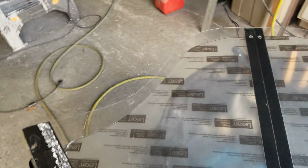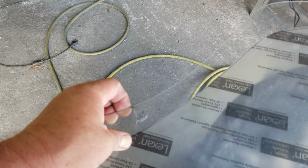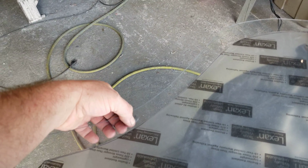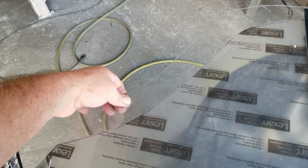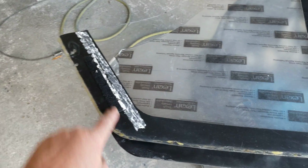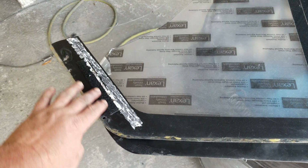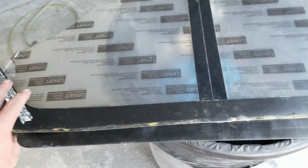It's not in horrible shape, but as always, whenever you do something, you figure out ways that you can do things better. One of the problems I was having was that this was starting to crack, because I had put some Adel clamps directly on it, coming off of the landing gear struts, so they were stressing the plastic and it caused a crack. And then there were multiple attempts at how to secure it or isolate it from the side of the fuselage so it wouldn't rub too much. But anyway, I'm pretty happy with the shape of it.